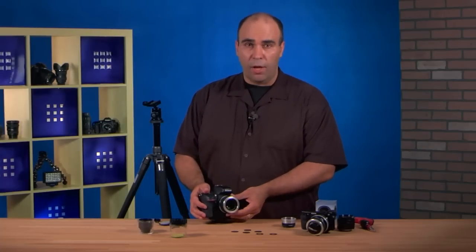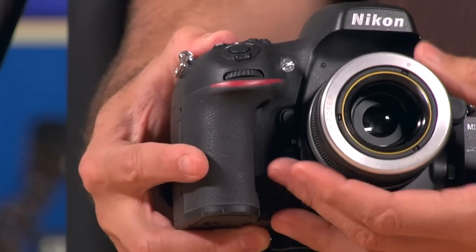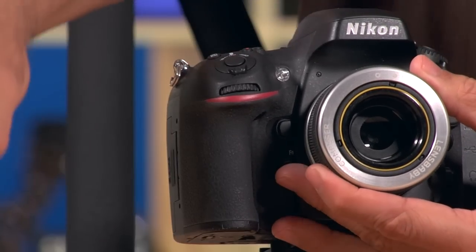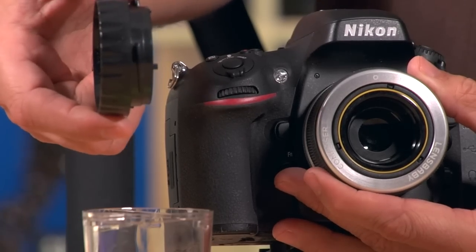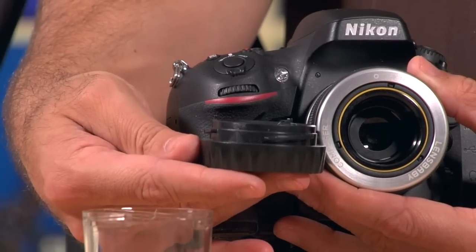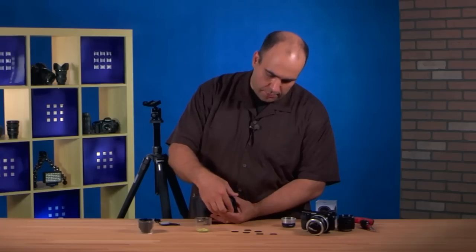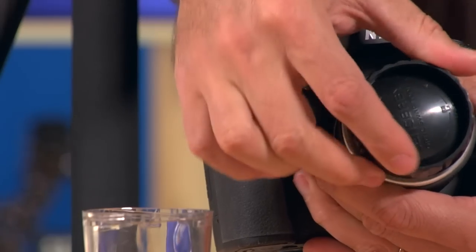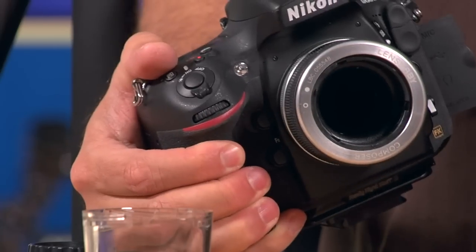So I just need to take this off first. To do this, I just need to adjust so the lens is right up towards the top, and then I actually take the lid right off the top of one of the optic holders, and at the bottom is a series of little notches. You can see there are a couple little notches, and those just line right up with the lens. It grabs on, and you turn. There we go — it loosens it up, and I can take it right out.